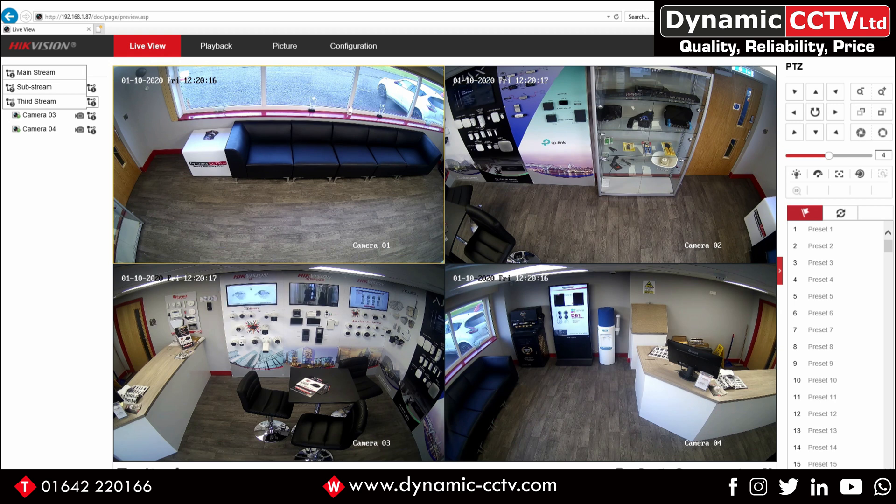You've got a full 360-degree field of view. Starting at the door in the top right-hand corner and moving across these panels, the panels start and go across to the second door within the trade counter. Camera 4 then starts and moves across to the front window, and camera 1 starts at the window and moves across to the door again — so there's full 360-degree coverage. There will be a blind spot underneath the camera which will vary in size depending on how high the camera is mounted — the lower it's mounted, the smaller the blind spot; the higher it's mounted, the larger the blind spot area.